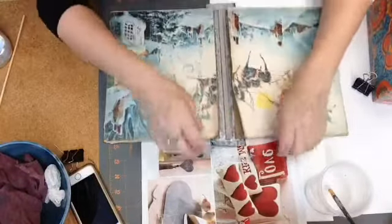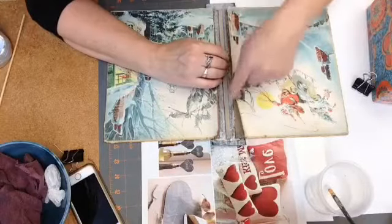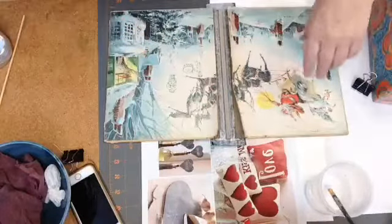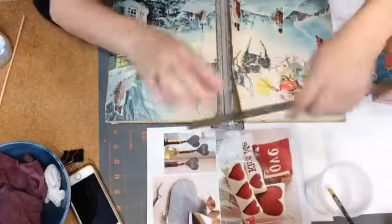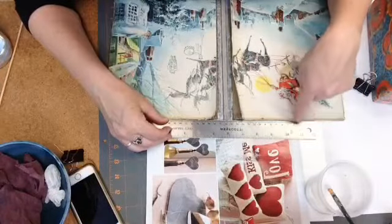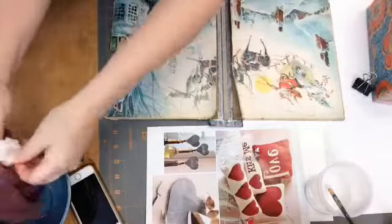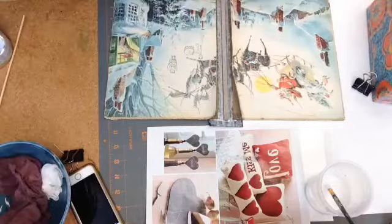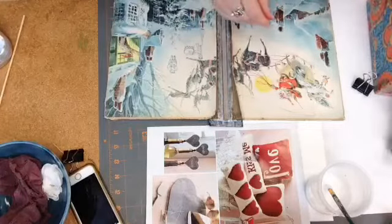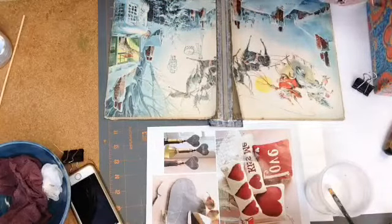Feeling like I wasn't very careful, and I didn't make sure that the spine is just a tiny hair over the height of the boards here. So for instance, if I took a ruler and went like this, you can see there's a gap here because this is actually sticking out a tiny bit. But instead of trying to move this whole piece down, which I could do, I actually like the fact that it's just a hair in. And so instead I'm gonna cut it, which is a little odd maybe, but there you have it. That's what I'm gonna do.